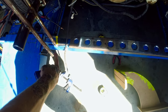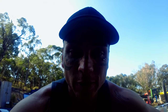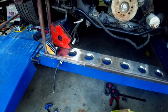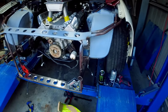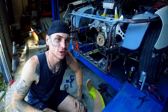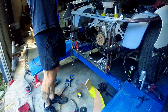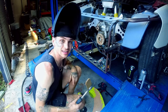I'll level these out a little bit more - this is the only one that's low - then straighten them all out and tack this piece on. I'm back - we were messing around with the Carina trying to get it to run. I've ground the bottom down and I've got a million magnets trying to hold this piece on. I got a couple of dogshit gasless tacks on there because I forgot there was still no gas in the MIG. I've swapped the bottle and now I'll get a couple better tacks on it, then weld all the way around.